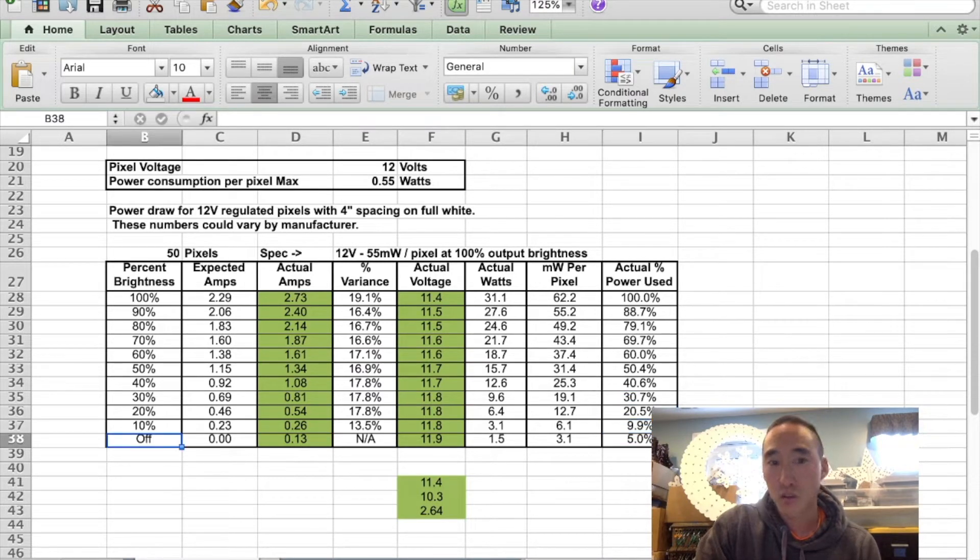The third thing to note is when all the pixels are off and we're expecting them to use no power — as we saw in the beginning of the video — it is drawing a little bit of current. Against that voltage, we're using one and a half watts across 50 pixels, even when the pixels aren't doing anything. That's 5% of the power being used on a continuous basis. Power is going to the chips and they're receiving zero signals — a bunch of zeros in the communication data line — so those chips are being powered. I personally prefer to power down the controller and all the pixels when the show is not running, as you are using the life of the pixels, at least the chips, even if the show isn't running. I prefer to shut down all those components and just leave the show player — the Falcon Pi Player on a Raspberry Pi.